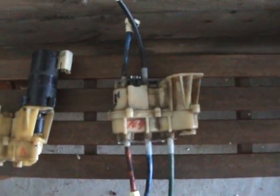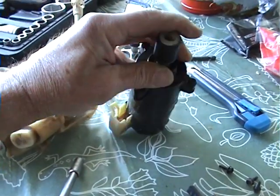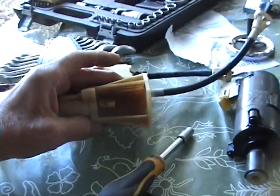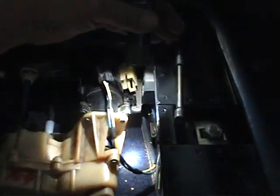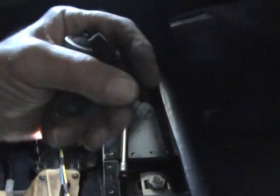So what I'm going to do is take the motor off the old gearbox and put it on my new secondhand gearbox. I don't even know if you can buy these anymore. Just a little 7mm socket to undo these nuts on the motor. On the end of the motor is a little coupling that goes into the gearbox. The shaft lines up into the coupling so I'll just put that in and screw it on. I've got all my winding shafts connected, and now I'll put the bolt in the clamp — it's a 4.5mm Allen head.